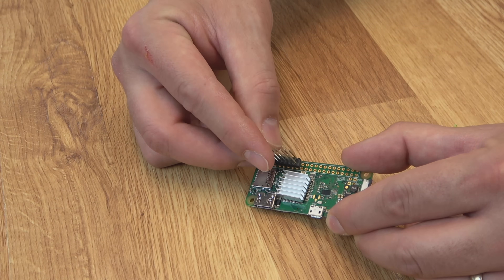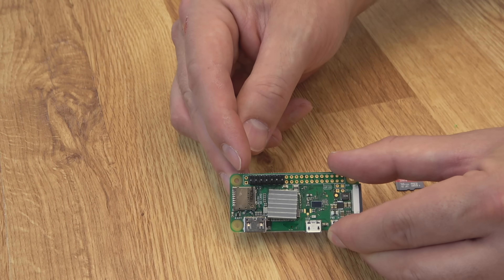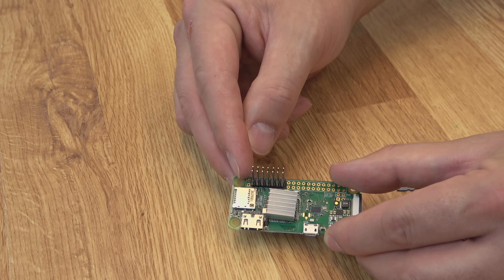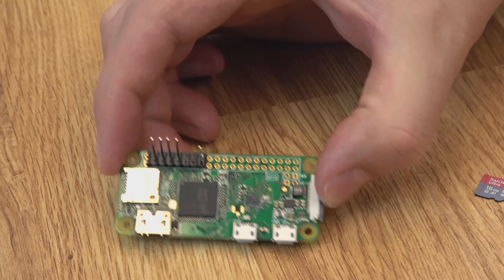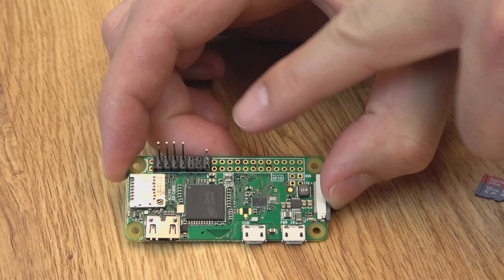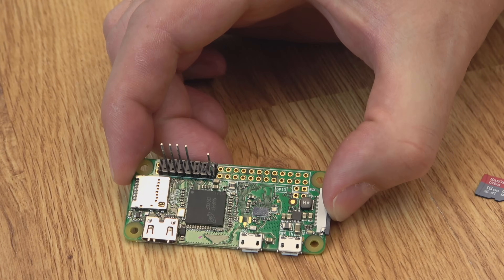The pins go on the board right here. You skip the first set of pins and then put them on the second set, but you only need five of these pins. I just solder the five I need and then pull them out. After you get them soldered, remember you have seven rows but only four pins here — we start on the second one, and then one pin down here. That should be all you need.